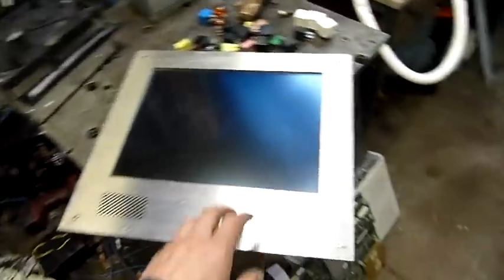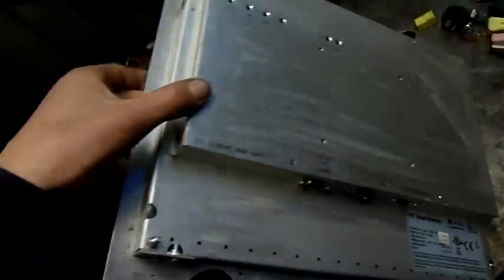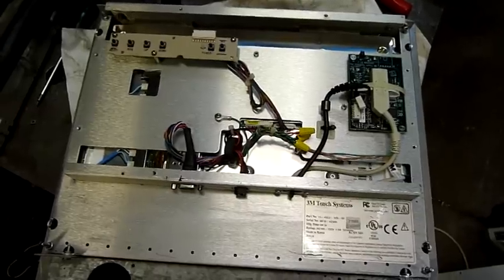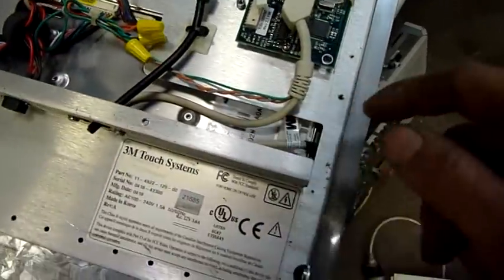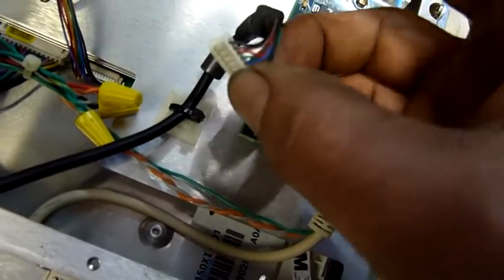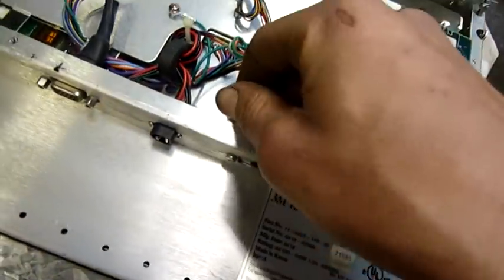Let's get this sorted out. It doesn't appear to have been wet, although being stainless it's hard to tell. I'm just going to take a gamble and put power to it — let's take the back panel off first. Inside it's not much different to any other monitor apart from the 3M MicroTouch module that's in there, which goes to the front of the panel. This one here which I disconnected is the cut-off lead — it has black, brown, red, green, blue, and another black which is heat-shrunk shielding. So there's a ground shield and then 3, 4, 5 cores. Might be USB — we'll have a look at that.